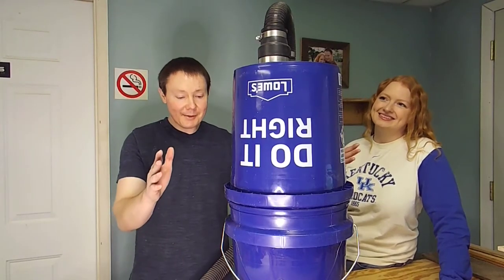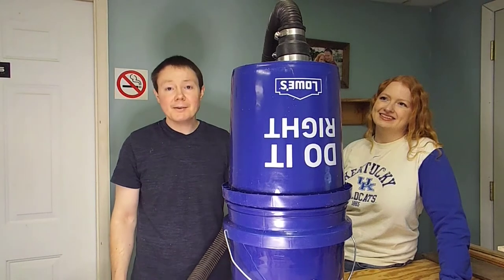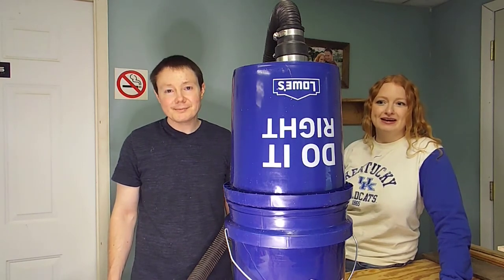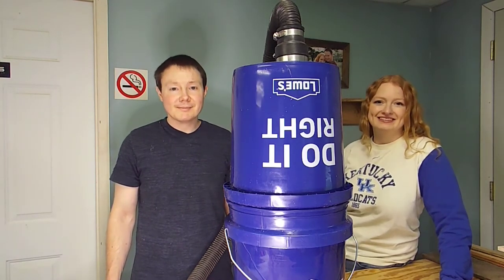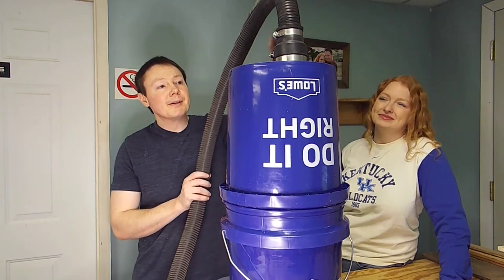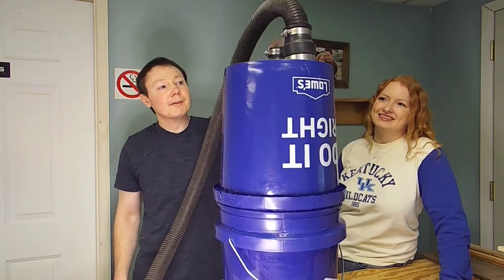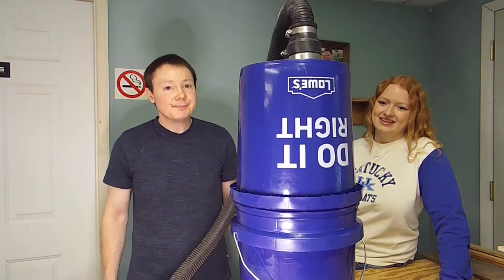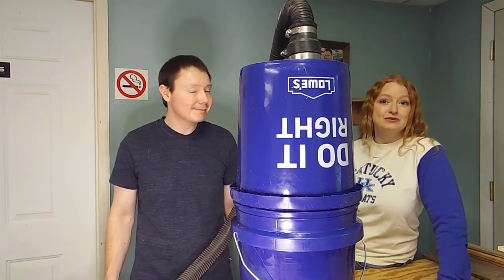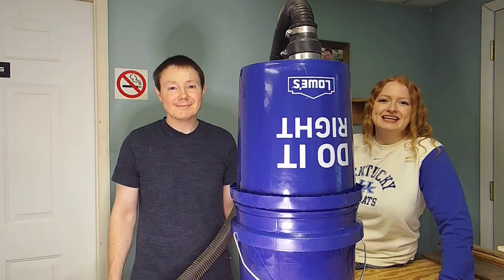There you have it. This is our version of a dust separator made out of two five-gallon buckets and some PVC piping connectors. It's really a great addition to the shop — it's going to give us much longer life out of the new shop vac, and we think it works great. We've actually used our old shop vac hose here. The way I have this set up, it should never have to be taken off of the separator, and you can hook and unhook your shop vac hose anytime you want just by sticking it in and pulling it out. If you found this video helpful, be sure to leave us a comment below. Don't forget to like, subscribe, and ring the bell. Thanks so much for joining us today — happy woodworking!